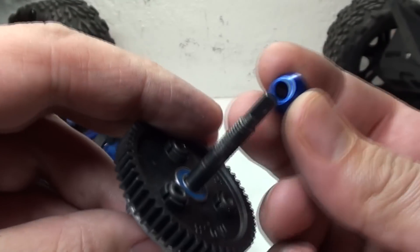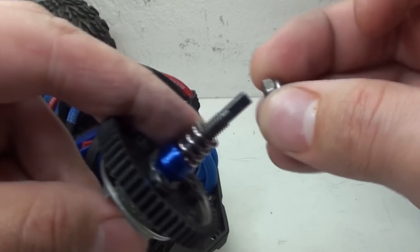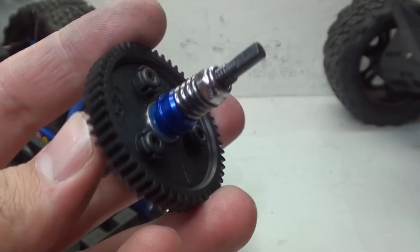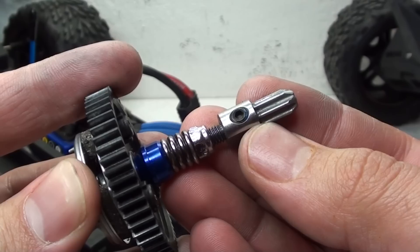So it's the reverse process. I'm going to go ahead and put the cone shape down, followed by the collapsible spring, and finally that nut. Now I'm going to go ahead and screw the nut all the way down and undo it half a turn. And already it looks a hell of a lot better. So now I'm going to go ahead and reattach this end piece and tighten down that grub screw.